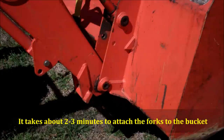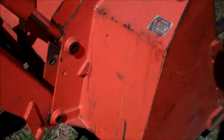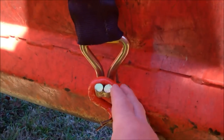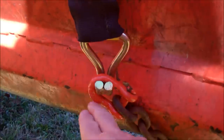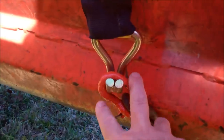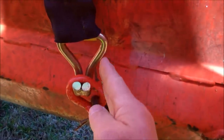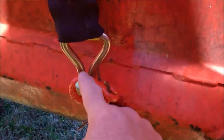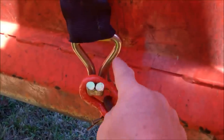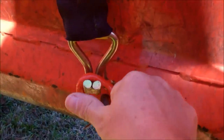I picked up some pretty good sized trees yesterday so I know it works and works well. Now, the reason I said I would rather have a bigger D-ring is because the way this is hitting is kind of from the side — these are too wide to go in the very end. In other words, where this chain could be pointing more up than sideways, it has to hit it from the side. So I'll buy a little bit bigger D-ring, a little wider, so this hook will hook straight up instead of canted off to the side.